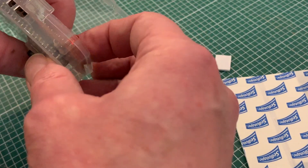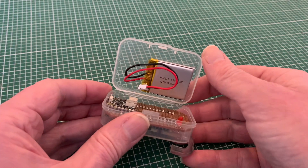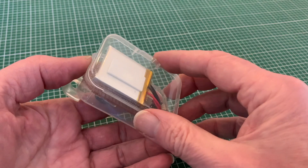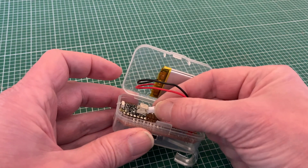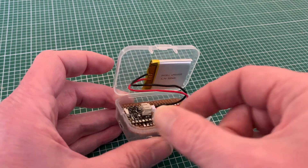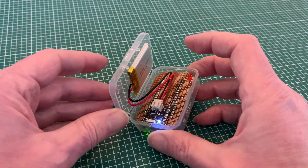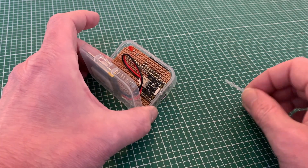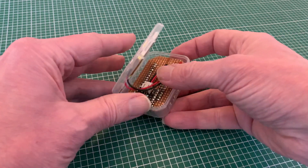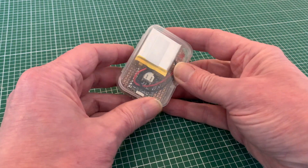This simple solution turns out to be more than adequate, so I've used the same approach to attach the battery to the inside of the lid of the box — a little off to one side to allow for the LED. I can plug it into the two-pin JST socket on the Pimoroni shim and our water monitor leaps into life, automatically launching our Python program which interprets the lack of a sensor in the same way as a lack of water. Then having switched it off I can carefully route those cables around the socket and close the lid.